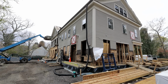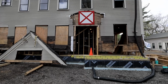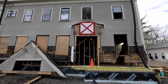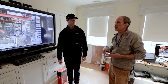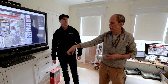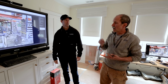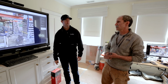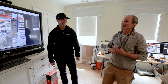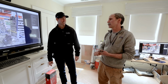And then ultimately, once you got to the level you needed, then really it's bring a foundation crew in that's the same as probably your new construction foundation crew, right? It is. What's kind of curious is that the fly in that particular ointment is that the foundation people are used to having their cages for their formwork craned into the center of the hole, and then everybody can move the forms out of there. So there was a lot more carrying involved. The logistics of that, they were very grumpy about that, so that every form had to be carried a larger distance.